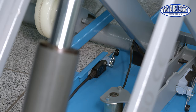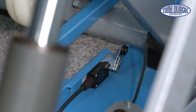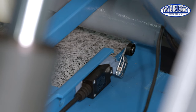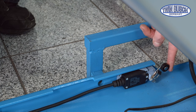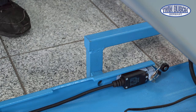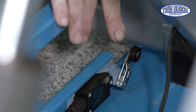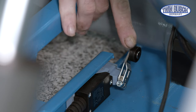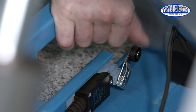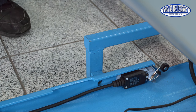I'll show you where it goes. You can see the limit switch for the upper disconnection in this area. It is touched by the cross beam while lifting up — the lift moves up, touches the small roll on the sensor arm, and switches off the lift. It works well with the setting at the 2 o'clock position, or 45 degrees upwards — 90 degrees would be flat, and 45 degrees would be an ideal setting.